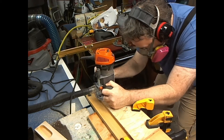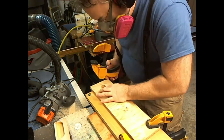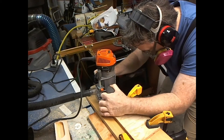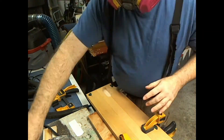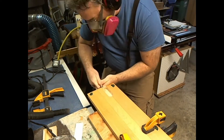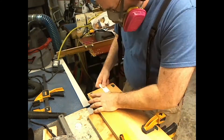Now I'm doing the real final piece — going along, so far so good — and then the template moved. I had to readjust and clamp it again, hoping it would be fine. Luckily it didn't shift too badly. That part worked out well. I cleaned it up nicely using the chisel method and a little saw. Since I hadn't changed the settings on the saw or router, these were pretty much drop-in fixes.